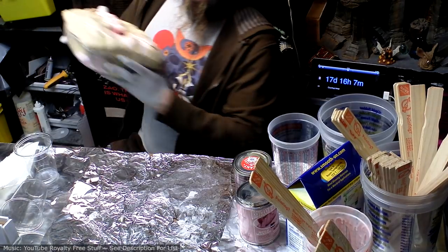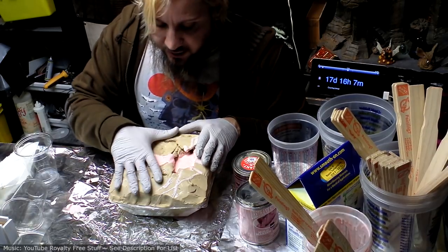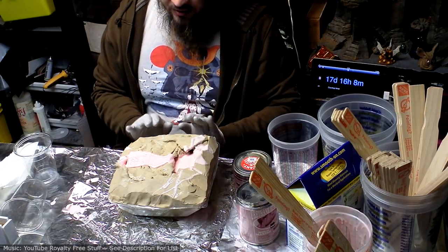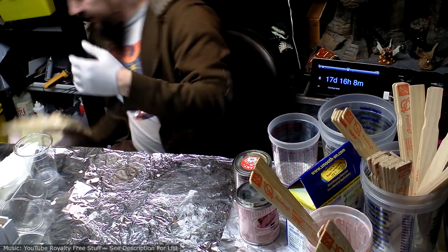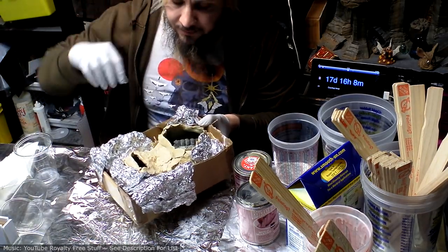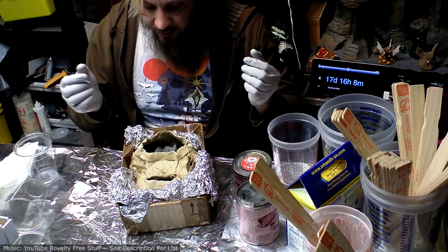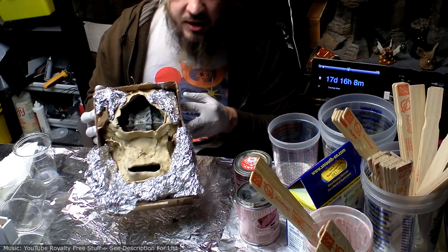So, you see a lot of these molds that I was doing are almost completely covered with the clean clay, and that is to minimize the amount of the super expensive urethane rubber that's covering it. So basically, it's as small a cavity as possible in there to fill. Now, since I prepped these pieces to do the same pourable mold, they're all covered up funny, but since I now have to use a brush-on rubber, I'm gonna have to uncover them. I just thought that was cool how that looks like a Cyclops alien or something.